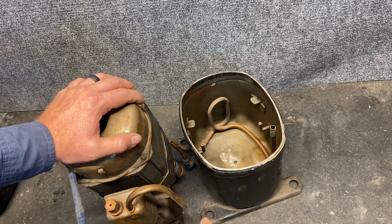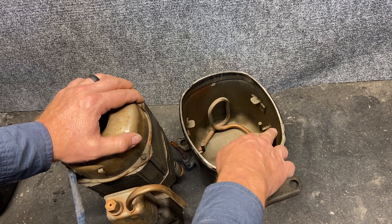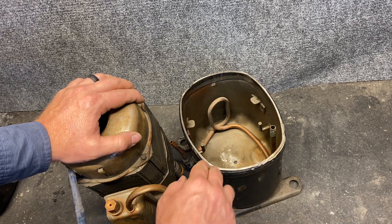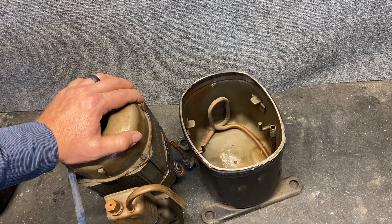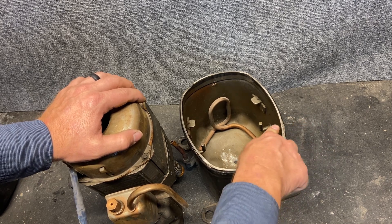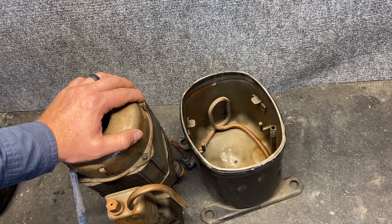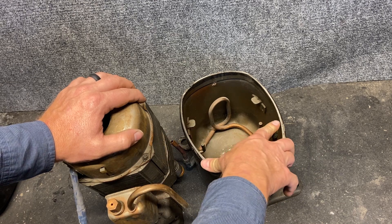We want to measure our discharge line to make sure we never exceed 225 degrees Fahrenheit. That's because in here it's going to be much hotter, and running down in the oil will actually cause oil breakdown. Not just that it runs at the bottom, but also this pipe has all these loops in it — those loops are in there by design. Because this compressor is on springs and needs to move, having all these extra bends allows this hard pipe to move around without breaking any lines. If you ever look at automotive brake lines, they will be curved coming out for that same basic design — it allows the cab to move separate from the body while still having hard piped lines.